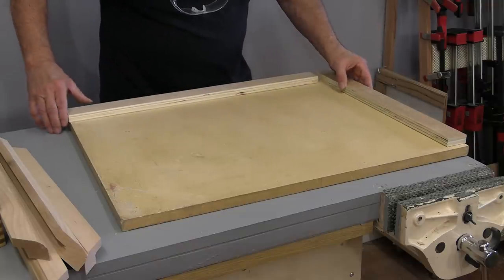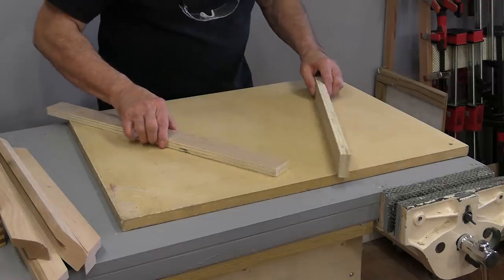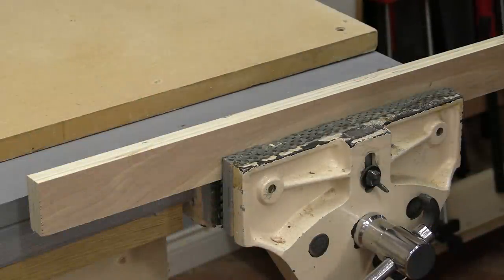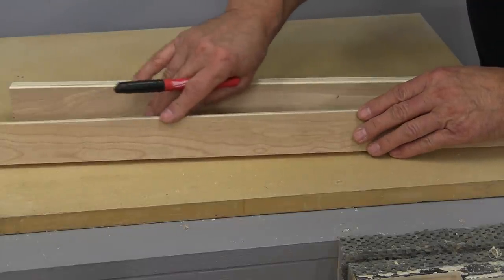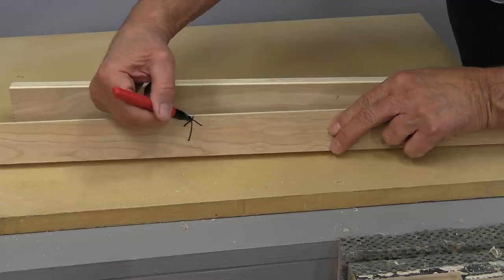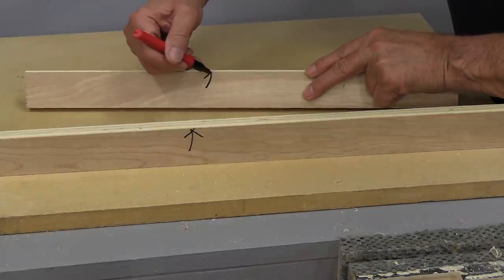The first thing I'm going to do is take a little bit of an edge off this. You can do this with a router, you can do this on your table saw — you don't have to take much off. I'm just going to take my block plane and run it down a few times. There's no rule as to how much you need to take off, just whatever you think is sufficient. Now I want to make sure I mark the right part, so I'm going to put an arrow underneath because that's the bevel side — I'm going to be gluing that down, so it'll hide the arrow and that's how I know where the bevel is going to be.